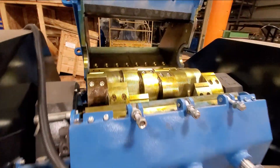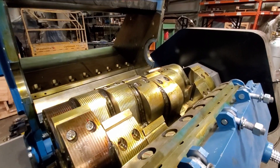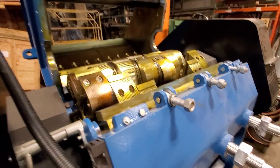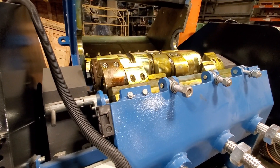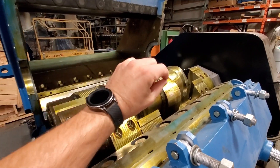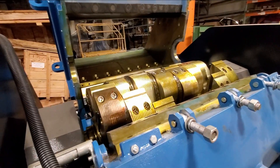The downside of a rotor like this is blade changes take longer — there are more bolts to deal with, so it takes quite a bit longer. But it's still designed in a way where it can be done pretty fast. There are adjusting screws in the bottom of the blade and a jig that the blades sit in. Once all the blades are out and sharpened, you set them in the jig, adjust each one to the bottom of the jig to make them all the same, drop them in, and tighten them. You don't have to fine tune them in the machine — just adjust the back screw, slide them in, tighten them, and then adjust the bed blade to the rotor blades.